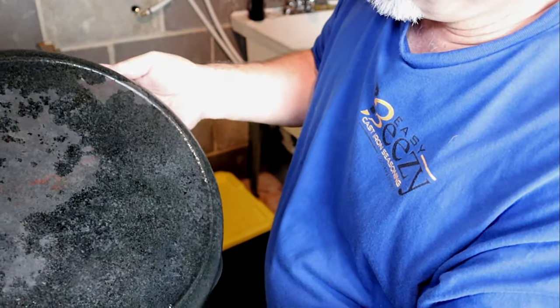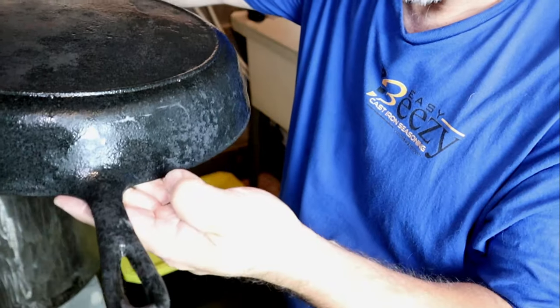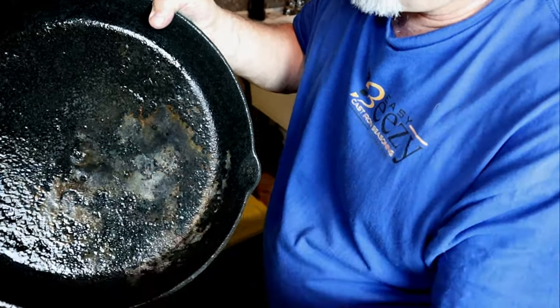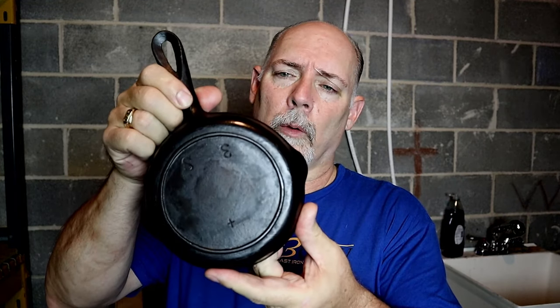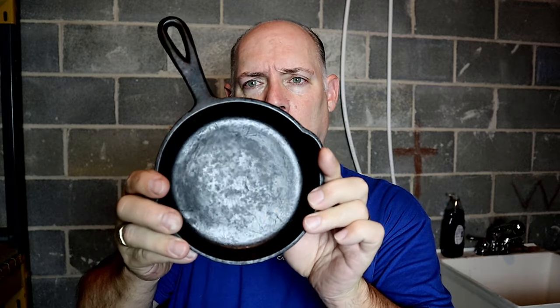This piece has a lot of staining. I've got all the old seasoning off, but it looks really bad. It's pitted — it's got some pits that a BB would fit in, some places where we've lost a lot of iron from rust. That number 14 is a pretty large piece and there was a lot of good action with the electrolysis. But I've got another little piece — a Birmingham Stove and Range 3S from the Red Mountain Series. It needs to be stripped; it's got a pretty decent seasoning on it. I got it used and never stripped it, so I'm going to stick it in there. It's a smaller piece, and we'll just see the difference in action between a smaller piece versus a larger one.